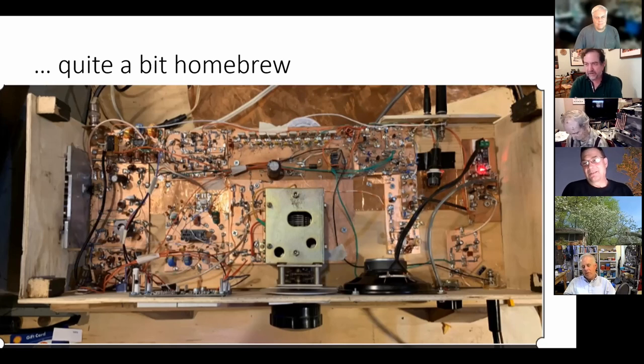It's almost the equivalent of an RF gain control you could have in there. Some guys even build it so they are able to turn down the IF gain, RF gain, IF gain, and AF gain. That might be overkill, but a switchable attenuator would be good. But I never really experienced clipping with this thing. And I think part of that is that there was really no need for RF amplification ahead of the mixer.